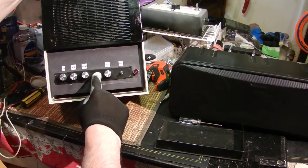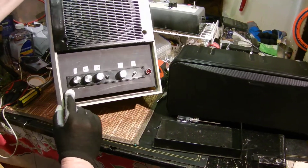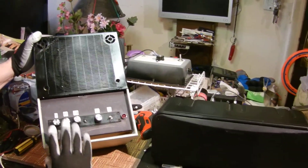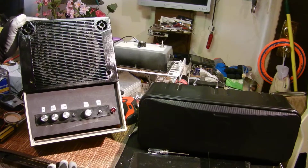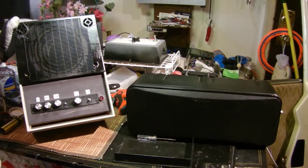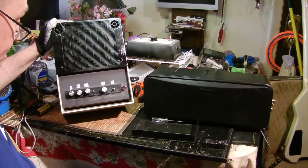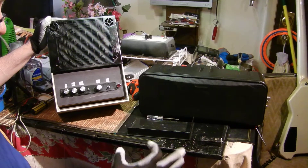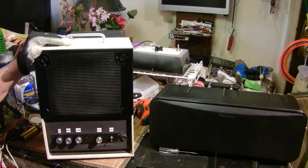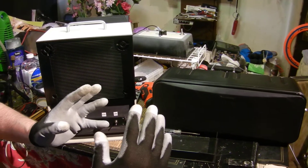I was able to mount everything on the VHS strip — you can see four little fasteners there to hold it in. And there's an EQ board: I got this EQ from eBay, it's called a bass guitar harness three-band EQ active pickup. It's got a nine-volt clip, a little box with the circuit, and three pots. I had two of these for stereo and removed the pots, then cut in a dual pot.